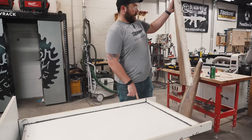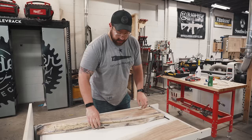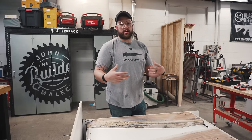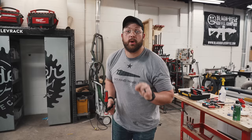I'm assuming mold release is just like Pam — spray it on and all your problems go away. That's how Pam works, right? As much as it would hurt me, we're not going to take any Pam sponsorships anytime soon. We should have a lot more stability on the front with this three-quarter inch piece of melamine — we're not going to get that flex. What happened last time we think is the pressure of the liquid bowed out and then cracked.